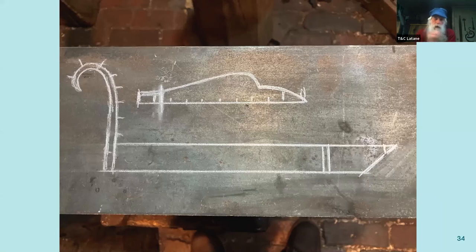A sample bolt was made by videoing the process. Using measurements from photographs provided by the Westerheim, an actual-size illustration of the bolt was laid out on a piece of eighth-inch thick steel — thick enough to lay hot metal on without warping. The scroll was drawn, and every half-inch was picked off with a set of dividers, then laid out showing what the scroll should look like straight before being rolled.